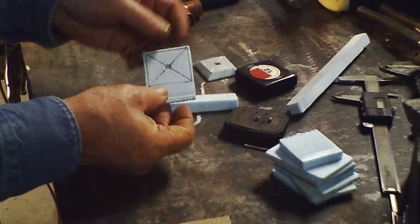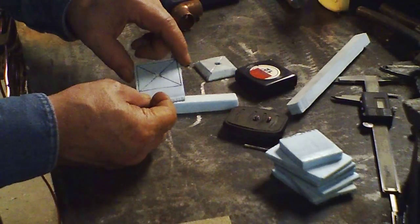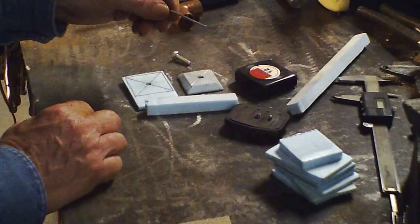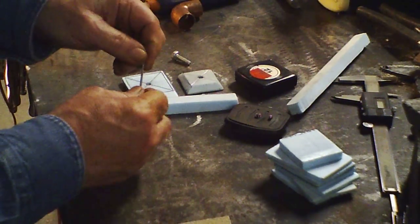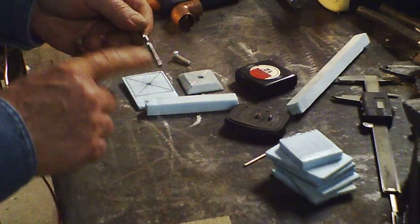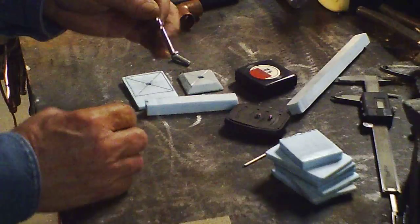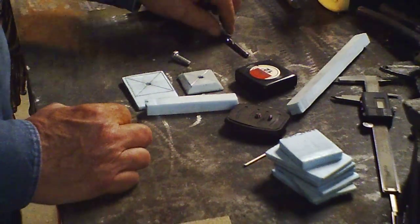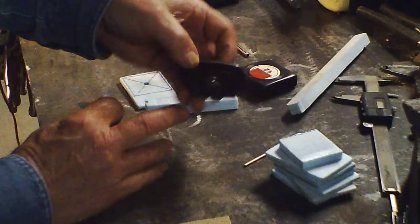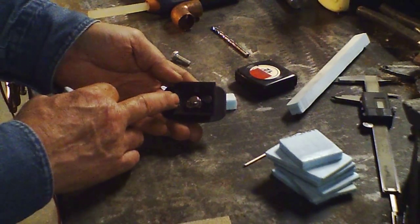After that I took the top plate and laid out the square for the top and got my center hole. The center hole is relatively easy — I just took a piece of leftover aluminum welding rod with a little jagged point and pushed it through the foam. Another thing you could do is take a drill rod the size you want, warm it with a propane torch just so it's a little bit hot to the touch, and push it through the foam. So I've got my two center holes in line.